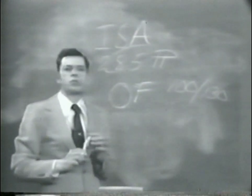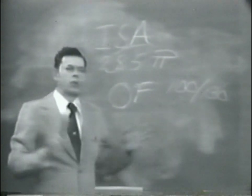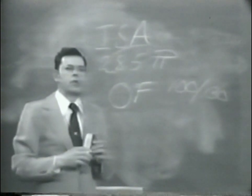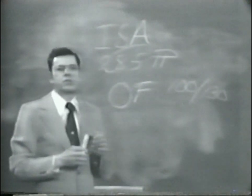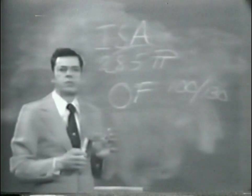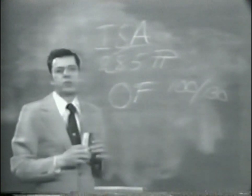There are quite a few reasons and safety factors built in that take away the complexity of knowledge you would have to have about the engine to avoid these conditions. But you only get that protection when the throttle is in the full open position, and you only need it above 75% power.